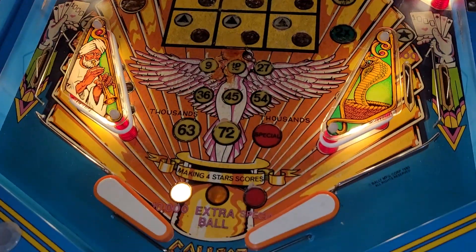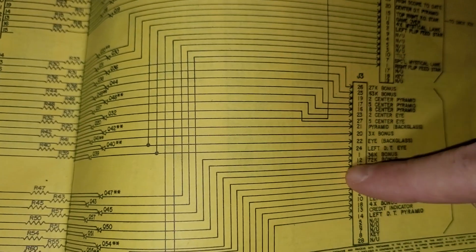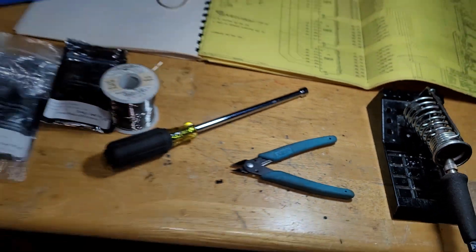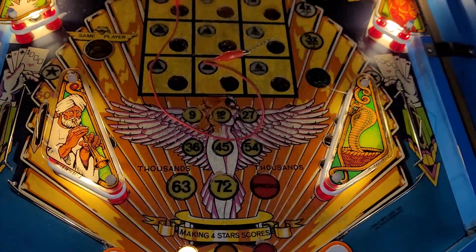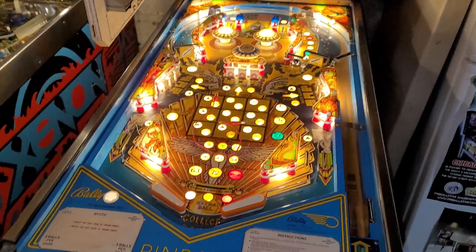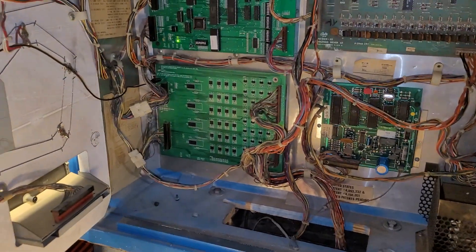It was my number 36 light that was not working. Using the schematic — J3 pin 1, 36K bonus — takes you all the way to Q57. We'll hit the lamp test and boom, it is working. Pretty happy about the results. It took longer than it should have because I really should have just started with the Hakko, but if that's handy for anyone else that's why I'm sharing. Surface mount repair — shenanigander style, thanks for watching.